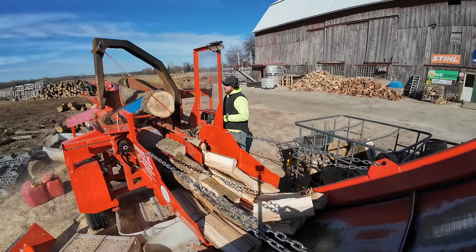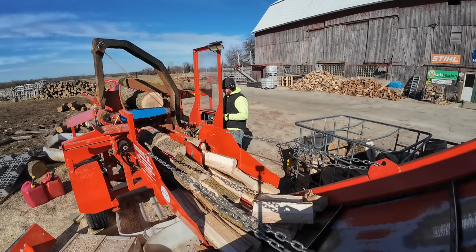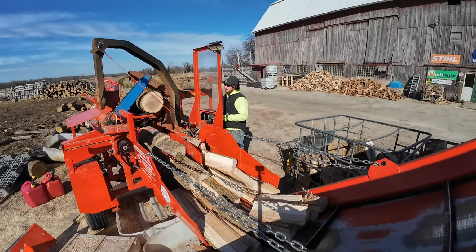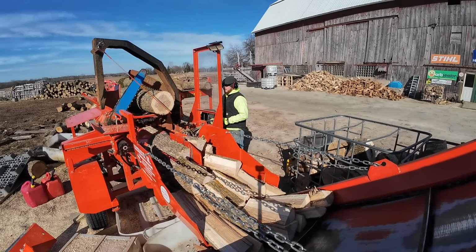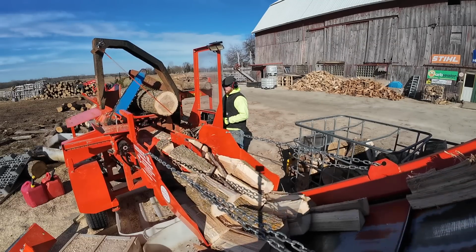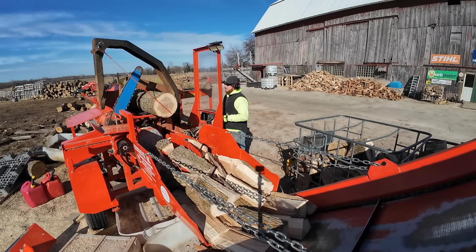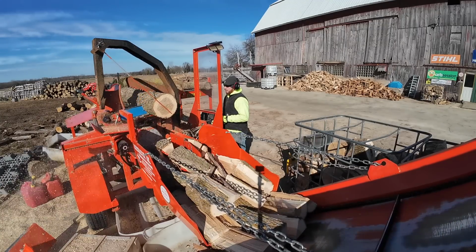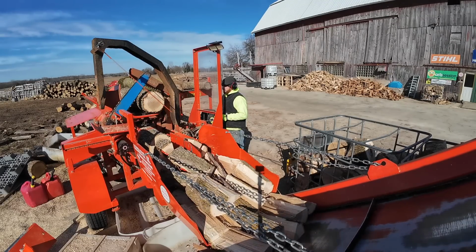And like I said, this ash is dry, and dry ash cuts hard. It's a slower cutting wood than even oak. Oak, everybody thinks is such hard, great wood, but oak is actually a wood that cuts pretty easy because it's very moist. It's got a very high moisture content, whereas ash is very low moisture content. So I think it cuts much harder. Once it dries out, it's real hard to cut. Tough on the saw as far as the power that you need to go through it.